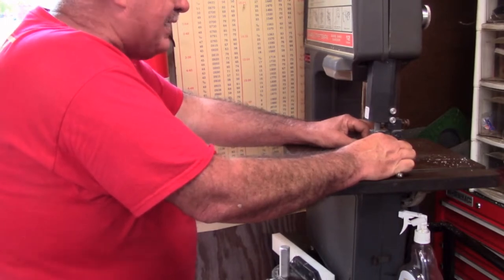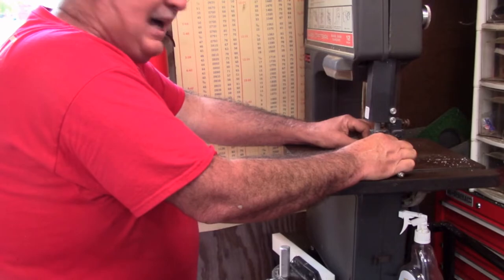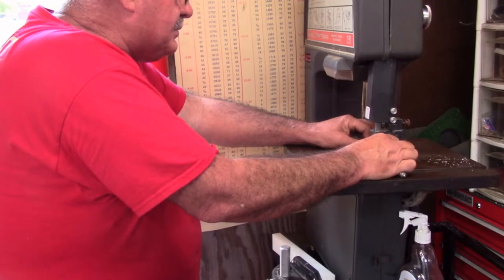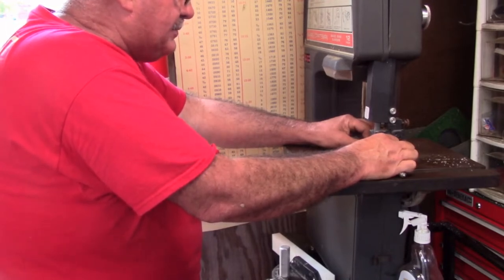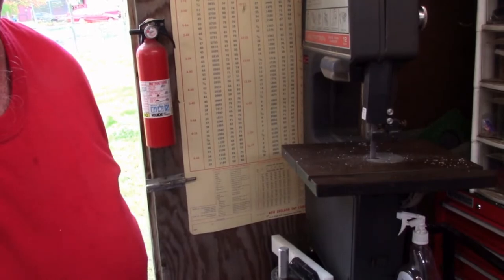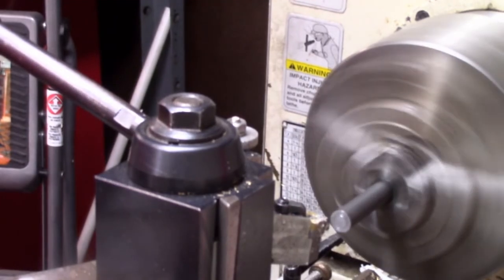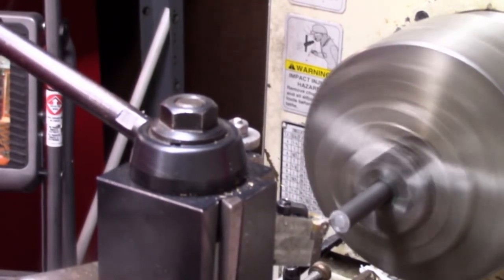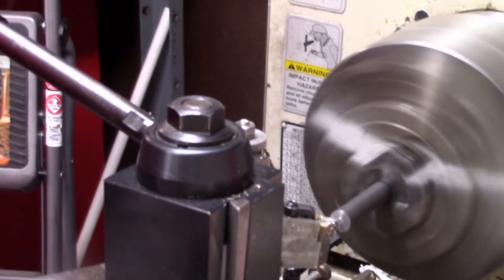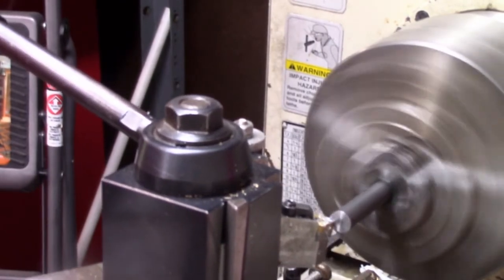This is a relatively small piece, and it's just a piece of mild steel bolt. It's a light bolt, so you know it's not very strong. So now I've got me a roughed out piece of stock here. Okay, there we go. We're doing a little facing here with it. I know I've got this out, but I don't want to re-chuck it for once, so hopefully that'll give me no grief here. This stock is probably just something like 10-18 or something. That'll get the job done.